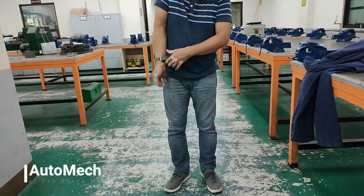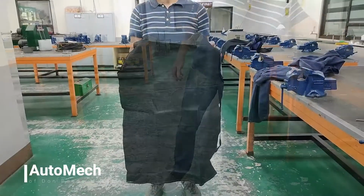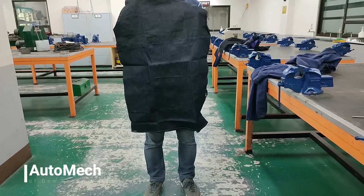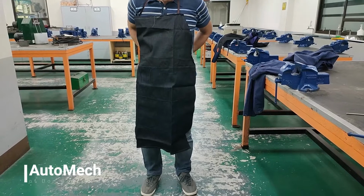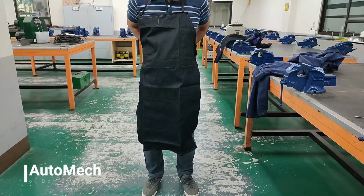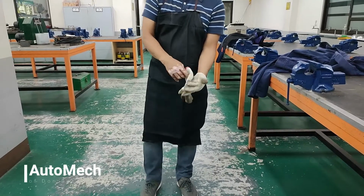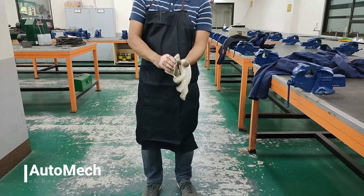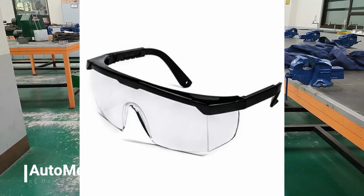All wrist accessories such as wristwatch and bracelets must be removed. The lathe machine operator should also observe wearing shop work aprons, which will protect the body from small debris that will shed off during operation. Wearing of cotton gloves is also advisable as it will serve as an additional protection to your bare hands. Also, never forget to wear safety goggles for your eye safety.